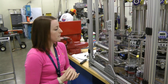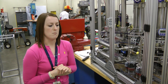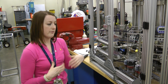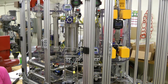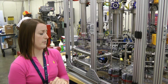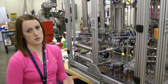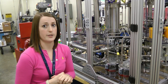Would you be able to use this on the Moon, Mars, or an asteroid? Water electrolysis systems are needed for every different extraterrestrial body, because you're going to be generating water somehow — whether that's through hydrogen reduction with regolith on the Moon or Mars, or simply baking water out of Mars regolith. You will need a water electrolysis system, and the same applies for an asteroid. So this is a universal system. This is actually the second generation design — we tried to move more toward a flight-like design that you could use on an extraterrestrial body. It has a higher production rate than the previous module, and we got rid of some consumables, since we won't be able to have consumables on an actual ISRU mission. We want everything to be gravity-independent with as little consumables as possible.